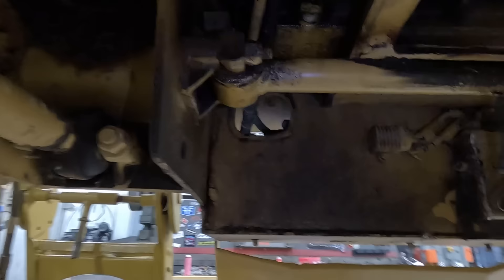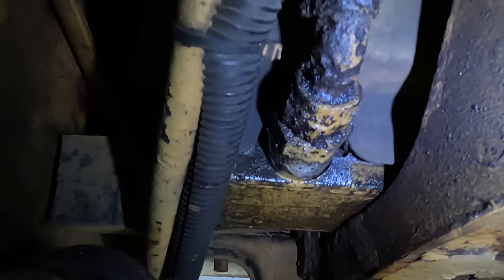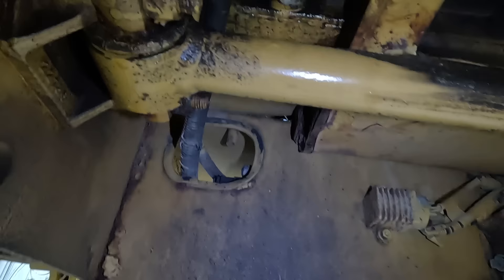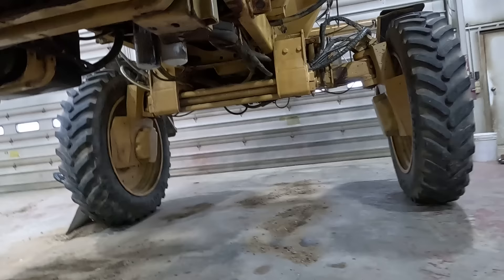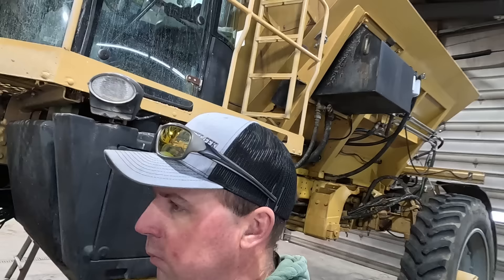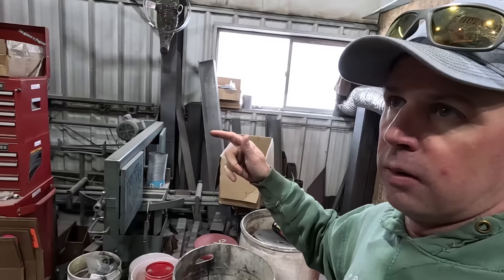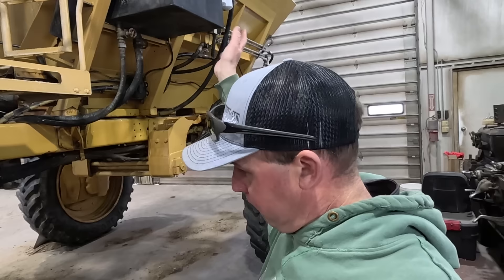Good morning. So we are under the Rogator and we have a bad hose. Pretty sure it's just because it's rusted so bad, and it's just puking out right here. The fun part about this hose is it goes all the way back to here — it's a long hose. We got to get it off the cooler first. It runs all the way back to the filter housing. Pretty sure it's one of the hoses for the drive system — the wheels and the rest of the machine. The spreader box has its own separate hydraulic system.